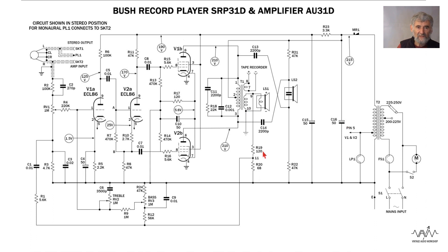Going back to the feedback, there's a potential divider here so only about one-third of the voltage is actually fed back at this point. It then goes into a tone circuit — conveniently labeled — with a bass pot, a decoupling resistor and decoupling capacitor which short-circuits the treble, so this only handles the lower frequency end. If you turn the control towards ground, very little bass is fed back, therefore the amplifier's gain at bass frequencies increases. Conversely, turning it the other way feeds back more bass, reducing the gain and reducing the bass.